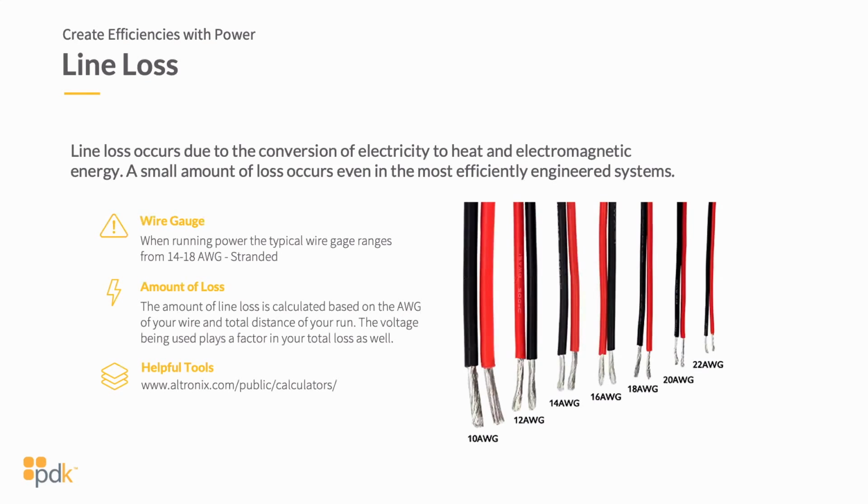On the back, when we get to the battery section, like I've addressed before, this also has battery calculations on it as well, and it'll tell you how many amp hours you're going to get out of a battery depending on how much power you're drawing, and how much time you want. Okay, so if we come back to the slide, again, look very closely at the different gauges. 22 gauge versus a 10 gauge wire. Even your 12, 14, and 16 gauge wire are substantially different. So the greater the number, the smaller the wire. The smaller the number, the greater the size of wire.